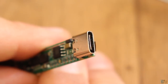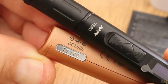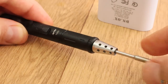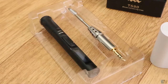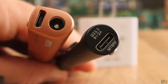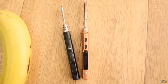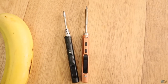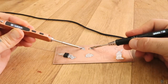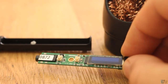One questionable aspect is the use of only a USB connector, since that will limit the use of limited-current power banks, external batteries, or power supplies as you'll need some sort of adapter. For now there are no replacement tips available, but there will be soon. I was waiting for this soldering iron for some time and I'm satisfied with the final product. The price is a little bit higher than the TS-100 but I'm sure it will get lower. So we have good performance, strong metal case, beautiful design, removable tip with 3.5mm jack, USB connector, and low input voltage so you could use it outside of the workshop. It is faster and performs a bit better than the TS-100, even with lower power. Let's wait for future versions of the firmware and new options.